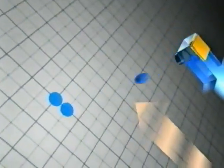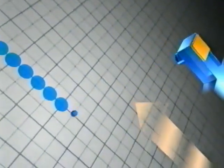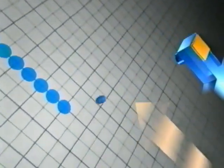With new microfine droplet technology, only a short distance separates the heater and the ejection opening, making it possible to cleanly eject all the ink. The effects of factors such as temperature variations are minimized, making it possible to eject a prescribed volume of ink with minimal irregularity. The ink is expelled forcefully, minimizing the effects of air resistance and ensuring precise placement of ink droplets.